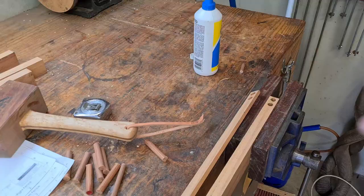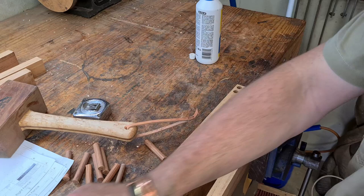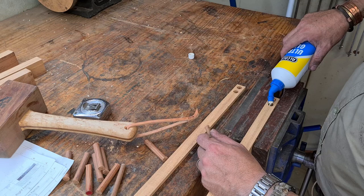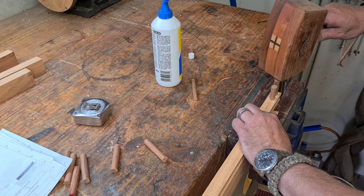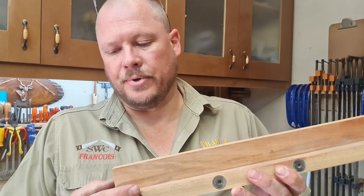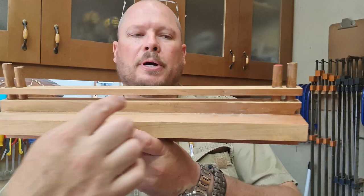All the components are cut and I'm going to glue them together. I'm going to use two 10 millimeter dowel sticks as spacers. All the components are dry; I left them overnight. They came out quite nicely. Instead of cutting the slot on my router table with the fence, I removed a piece of lumber on my table saw and added two dowels with a 9 millimeter spacer in between to get the correct height, and I've glued two dowels in.